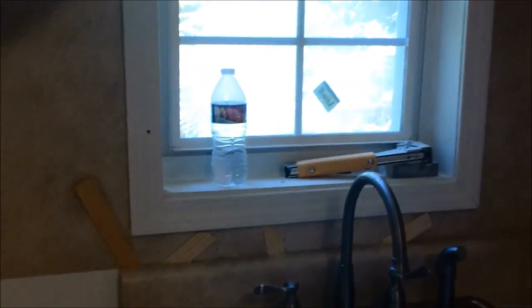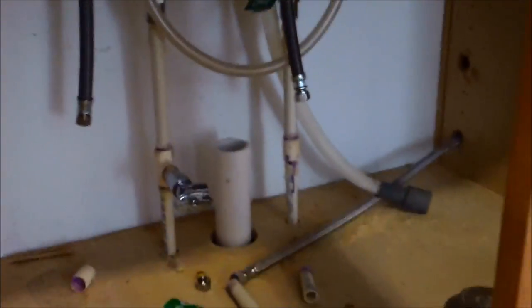I got some pieces of wood wedged to hold it on there. Did that corner too and did it behind the sink. My pipes are run and my shutoffs are on them. Now I'm going to go to the house and snake a wire to the fuse box for the stove. I got the wire going down there. My water lines are connected. What's next is the drain line — that's inch and a half — and there's a main sewer line so it's not that far of a reach. Here's the finished progress of the kitchen.